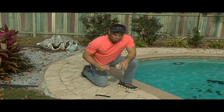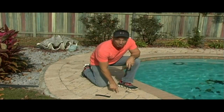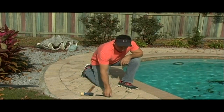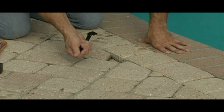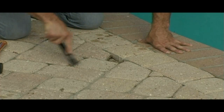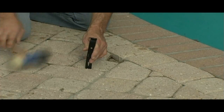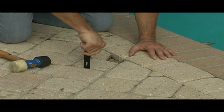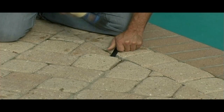I'm going to show you how to take this out. When I work with pavers, I always use a white rubber hammer — I never use the black end because the black part will make marks on your brick. So you use the white part to tap it in or take it out. All you need is some type of sharp edge — this is a small flat bar. You can use a painter's knife or a putty knife. You'll scrape this out a little bit — it's polymeric sand — and get yourself a place where you can get in between it. Take your hammer, tap it lightly, and start working it. Get it close to the edge and it'll pull up. I'll tap this one down next to it to help me get this one up.